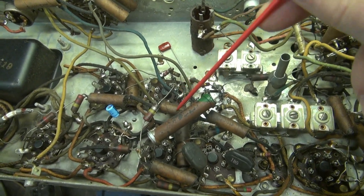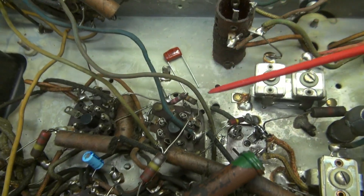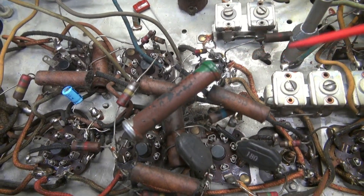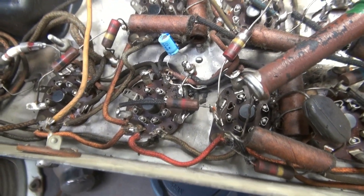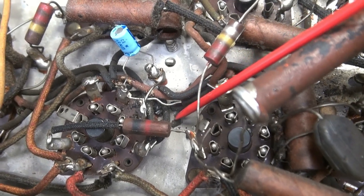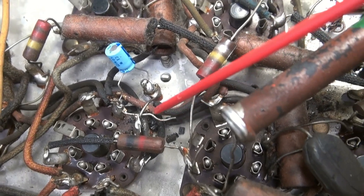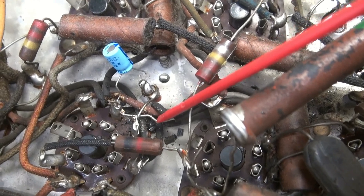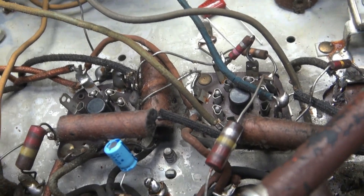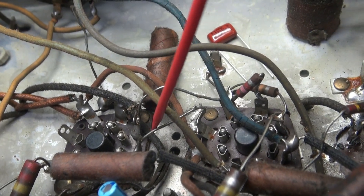Now it's time to change out all these old ugly wax caps. I'm going with this style capacitor, which I have great luck with. As you can see physically, it's much smaller than these, so it's going to kind of clean things up. If you look right down in here, you see all that shrapnel? That is insulation that is falling off these wires — this is kind of common in these old radios. I'm going to address that later. These caps are kind of buried under other wires, so you've got to cut the leads and push them out of the way. The new one will go right in there — lots of room.